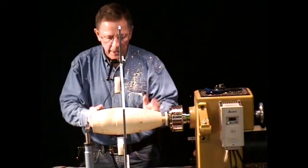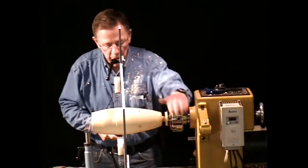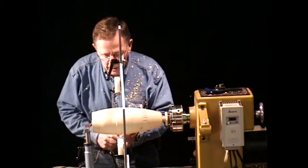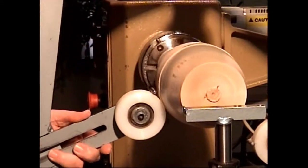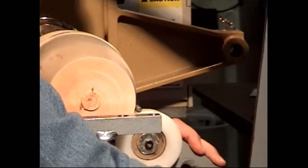we've put the center steady up here so that the wheels are going to be running on this little runway that we created. And you can see that since I moved that, we got a little run out. So I'm going to bring this wheel up until it just touches about half of that, takes up about half of that. And then I'm going to bring this wheel up and just touch the bottom there.